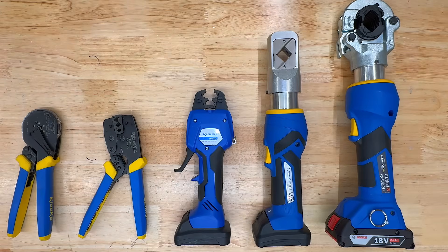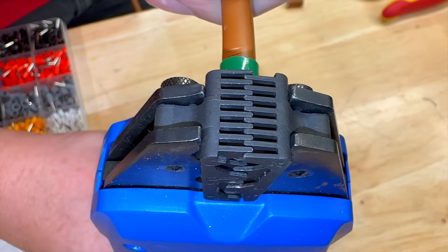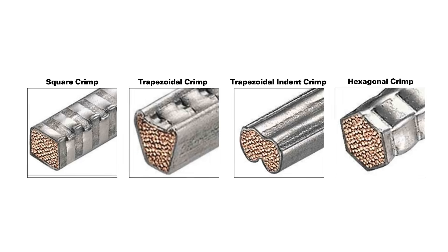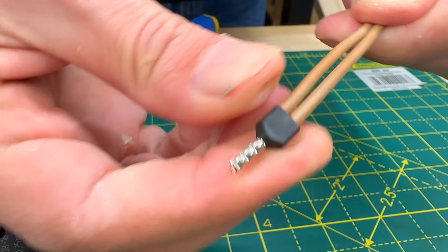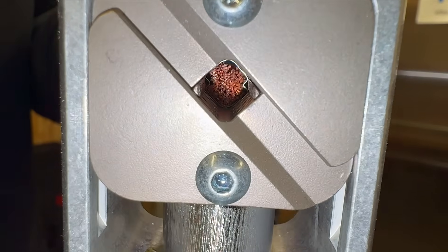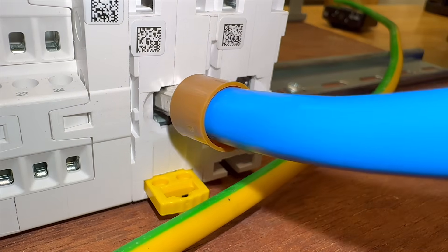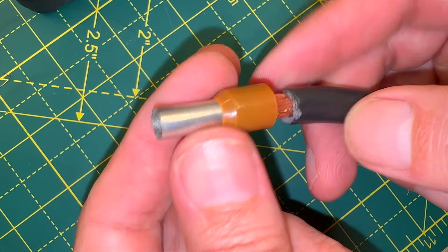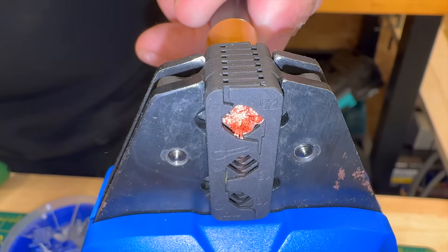Before wrapping up on crimping tools, let's address some frequently asked questions. Crimping tools create various crimp profiles — the most commonly used are trapezoidal, square, and hexagonal shapes. For smaller conductors paired with screw terminals, hexagonal or trapezoidal crimp profiles typically provide the best results. In contrast, larger square profiles are better suited for cage clamp style DIN rail terminals or circuit breakers, as they may not fit properly into round terminals. Another common question is how far the copper strands should extend beyond the ferrule — according to ferrule manufacturers, the copper should protrude no more than 0.5mm from the open end of the crimp.